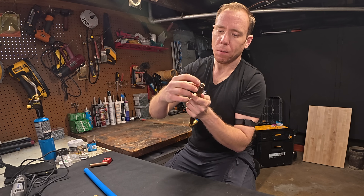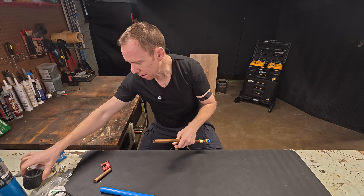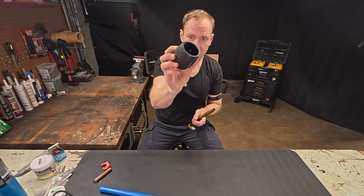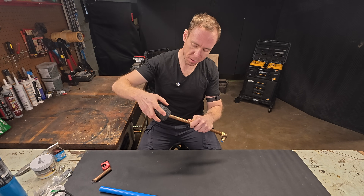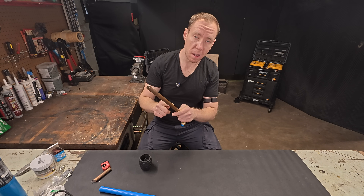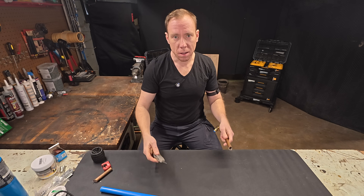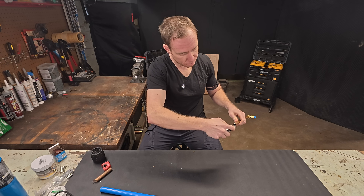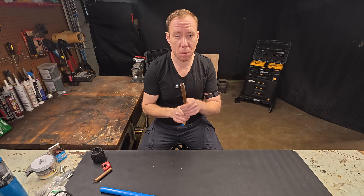You'll notice there's a little bit of a rough edge on the inside and the outside, so we're going to want to clean that up. The easiest way is to use an inside-outside cutter — the blades are shaped to work on the inside of the pipe. Just twist it to get rid of the burrs, which eliminates any chance of turbulence that could create pinhole leaks down the line. You could also de-burr with just a razor blade. But do not skip this step — you do not want burrs inside your pipes.